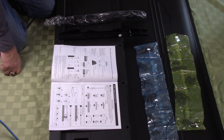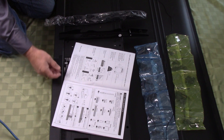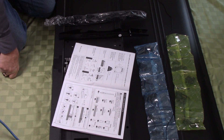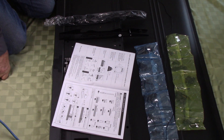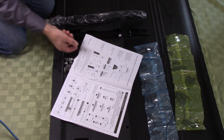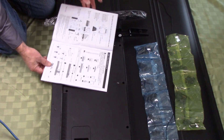We've already covered what the wall is made of — we're mounting on vinyl siding on OSB plywood with studs on 16-inch centers behind. The installation tools you need: a tape measure, pencil, screwdriver, cordless power drill, a half-inch socket wrench, bits, an awl, and a stud finder. We have all that together, so the first step is to attach the brackets to the TV.